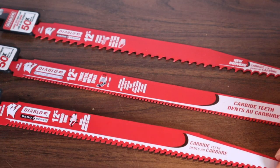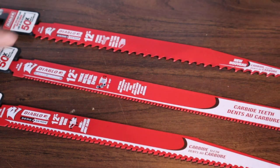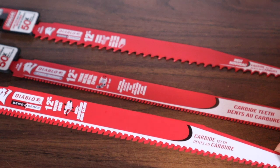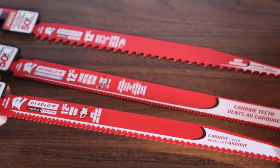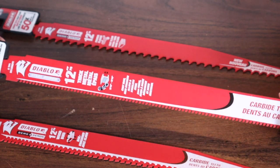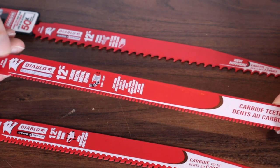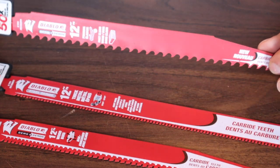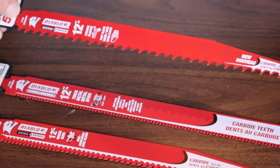Generally speaking, there are about three different types of reciprocating saw blades. You've got a wood blade that's going to work with wood. It's going to be a rough cut, it's going to work with embedded nails and screws in the wood, and it's going to have about five to seven teeth per inch — that means how many teeth there are in every inch. If you're cutting metal like plumbing, or you want a nice fine cut on plastic or metal I-beams, you're going to use a metal blade, which has maybe eight to nine teeth per inch. And then you've got a much coarser blade — this is going to be like an outdoor pruning blade or for really rough cuts on wood, and it's got about three teeth per inch.